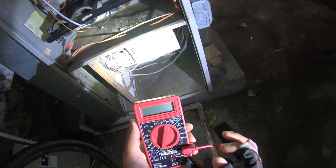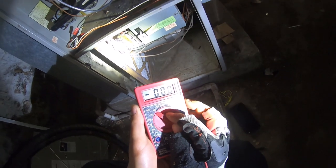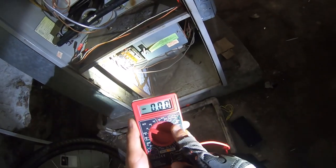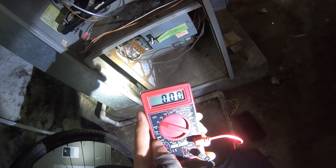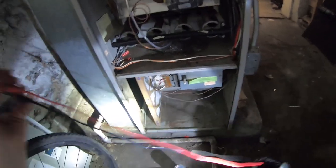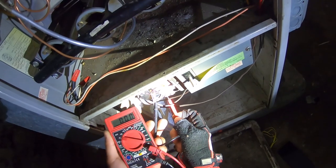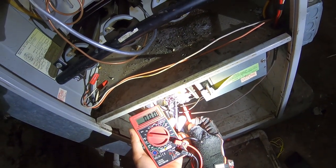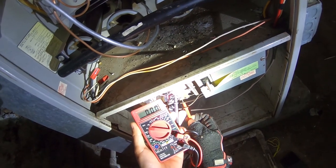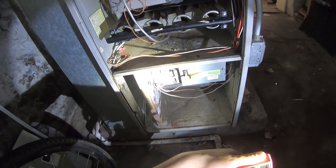DC, dude, I never used this tester in my life. All right. On DC, 24 volts. That's battery, that's something else. I don't know what this is. I'm going with this. Let's see what happens. We said Y and C, right? Oh, wow. That's not good news, man. Hold on. Okay. Let me turn this off. Let me open this up, man. Let me check the fuse in there.